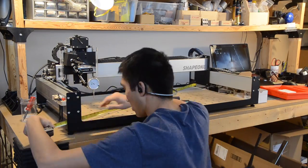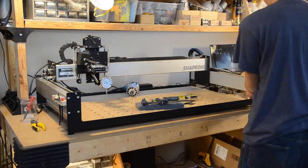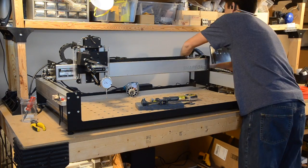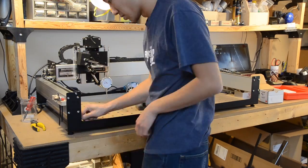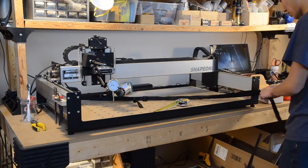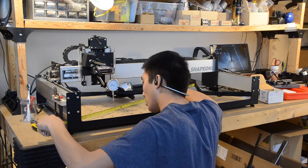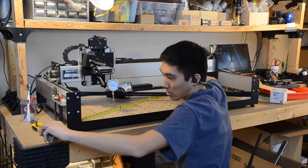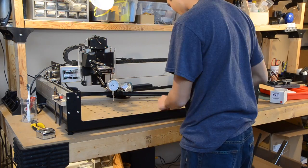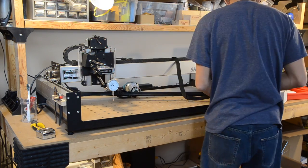Now, I started out by the book, working my way from the ground up. The first thing I did was to make sure my base was square. I measured corner to corner as best I could and tried to make the diagonals even. I loosened my wasteboard and rails, wrapped a strap around the longer diagonal, and added tension until my measurements matched within a 1/16 of an inch. Then I tightened up the wasteboard to lock the base frames relative to each other.